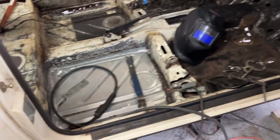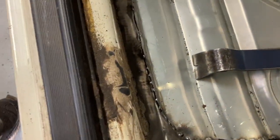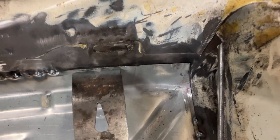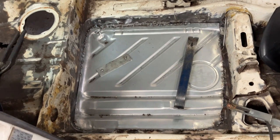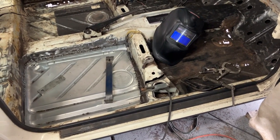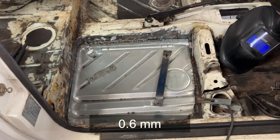I've been at it for a little while and haven't made it quite all the way around yet, but it's going pretty good. I need to do this little stretch — like 8 inches — just tack it. I've gone around the perimeter pretty much. I hammer it and press it in with this pry bar as I tack, and it's getting there. It's going to be welded, grinded, welded, grinded, then primer painted, textured, and hidden under a floor mat — standard operating procedure. Had to replace the welding wire, running 0.025 — the thinnest one you can get, I reckon.